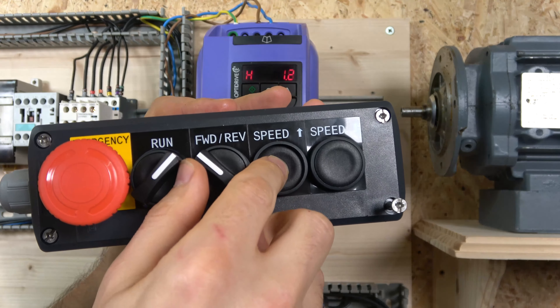So that's how the MOP control or two-button speed control works with the reversing function. Having done that, let's move on to the multi-frequency setup. The station has been wired in — here's what it looks like. We'll put the drive into run mode and there's speed one, speed two, and speed three. This drive never stops amazing me — it's built very differently than others, not bad, just requires a bit of extra thought.